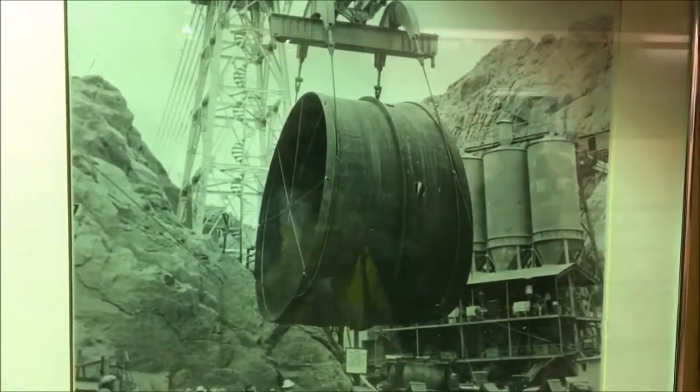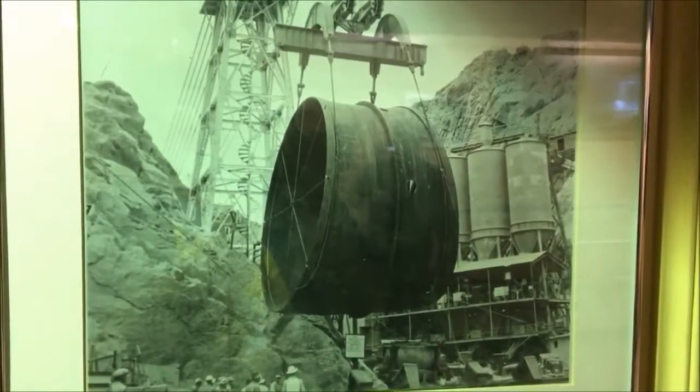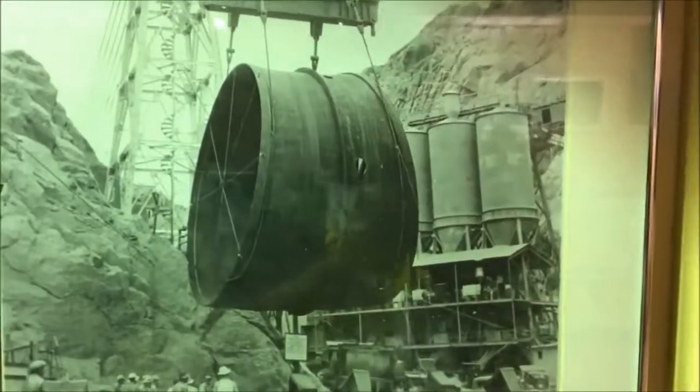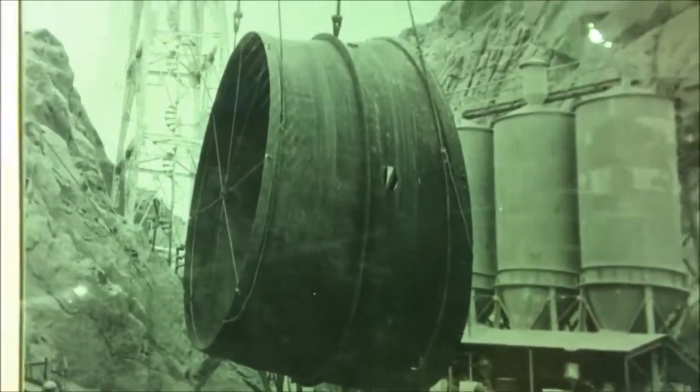The pipes are connected by pressure pins because rivets are rigid and would tear. A pressure pin has a little bit more flexibility. It's a 3-inch diameter steel pin in lieu of rivets. There's 272 pins. You can see the nipples stick the pipe together.